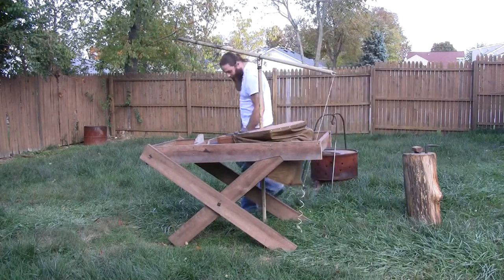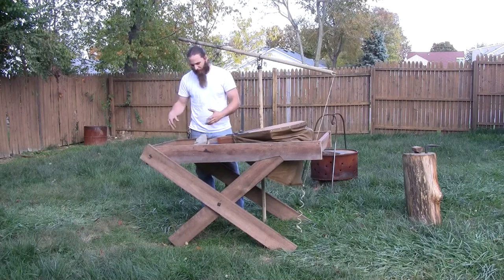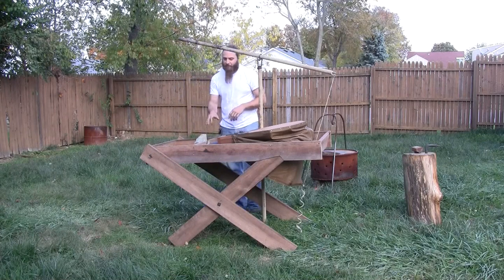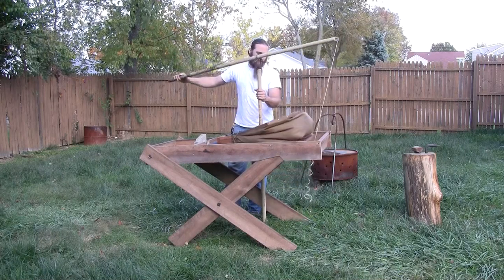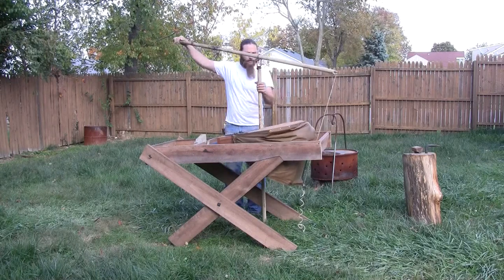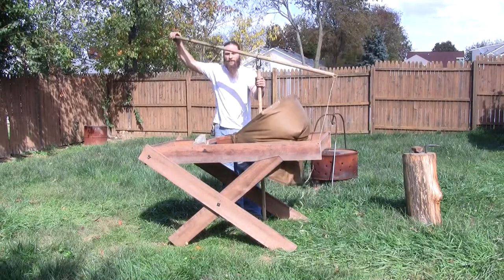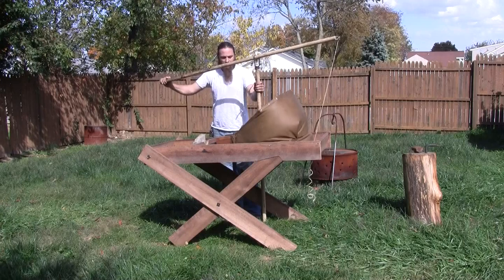It's ready to go. I pour about 50 pounds of sand in and that fills up this area — it's about 2 feet by 18 inches with about a 4.5 to 5 inch depth, and one bag of sand fills it up almost completely. The bellows works wonderfully. One pump to prime it and it will automatically continuously feed. Or if I really want to force some air and get a good heat on something particular, I'll keep the top chamber primed and force directly from the bottom chamber. Works really well — amazingly well.